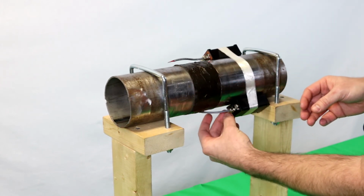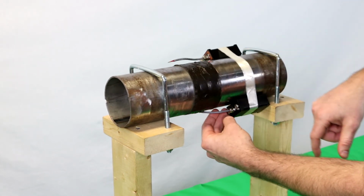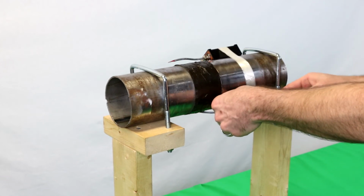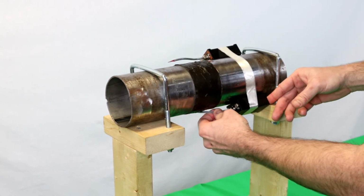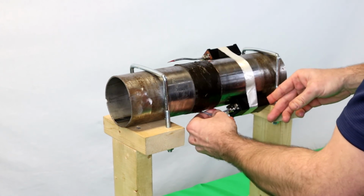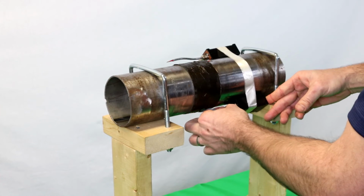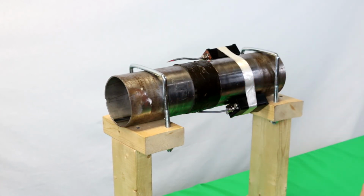And the thumb screws are there so that you can easily remove the housing cover if you need to replace your 9-volt battery. So you'll make them nice and snug. Then you'll take your cable and you'll push down through the gland, just enough to feel it nice and snug. You'll know that it's bottomed out at the bottom of the housing.